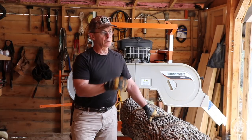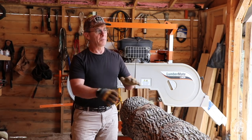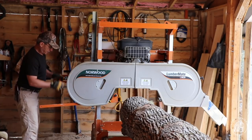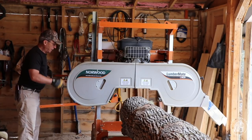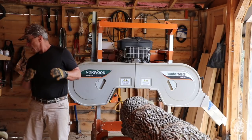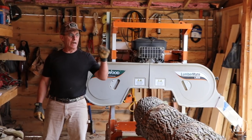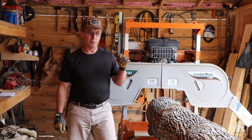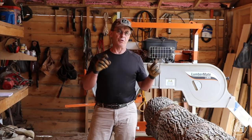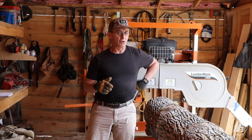I'm actually going to lay it vertical to give that a nice look up underneath, where I'll lay block up to the bottom beam and then use that as a backer. I'm getting a lot of good information. Also, someone else wrote to me suggesting I use a red and yellow iron oxide stain because by doing that I would get three times the longevity out of my boards due to UV rays. I appreciate that information. I haven't done any research into it, but it sounds reasonable — longevity is what I'm looking for, so I'm going to look into that.